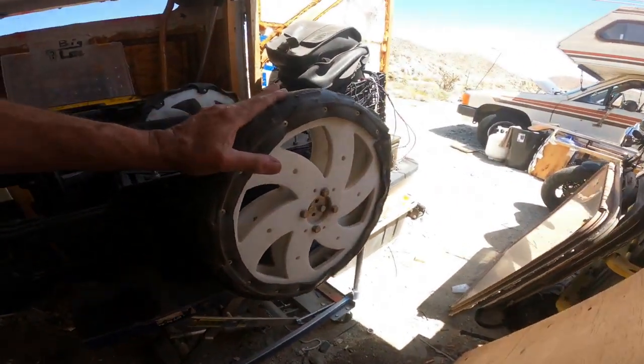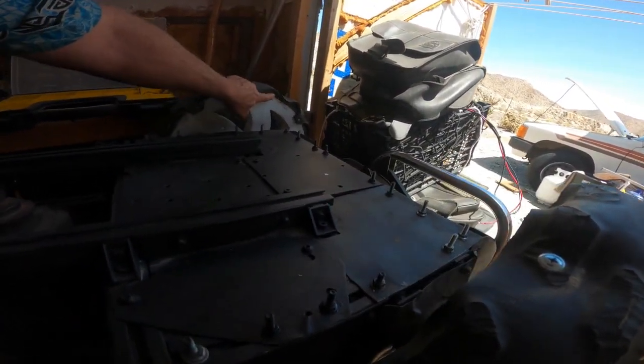The inner rim is actually running free around that piece of the billet casing. The outer rim is what's bolted to the motor, so it makes things a lot more bulletproof. I came up with this design after my fight with Warhead — I lost that fight and he ate my tires right off the robot. These are 18 inches of beauty. The big tires give me traction and make the robot completely invertible — it runs just fine whether it's right-side up or down.